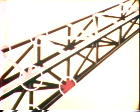Following this, one set of cross arms was welded on one side. Then, one set on each opposite side, always balancing one shrinkage force with another. Step by step, right on up to the end, so that the final result was a perfectly straight crane boom.